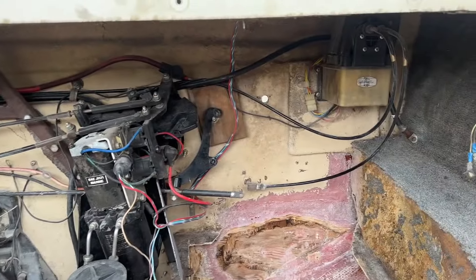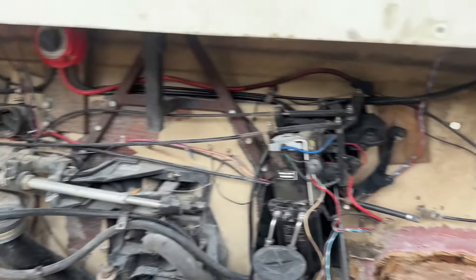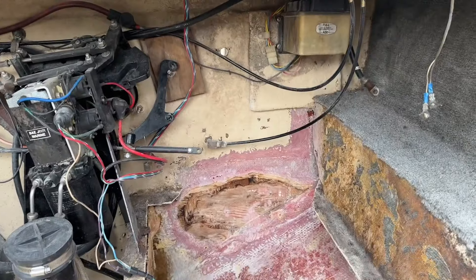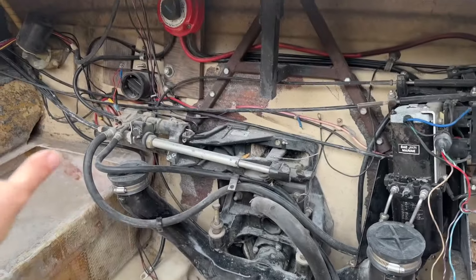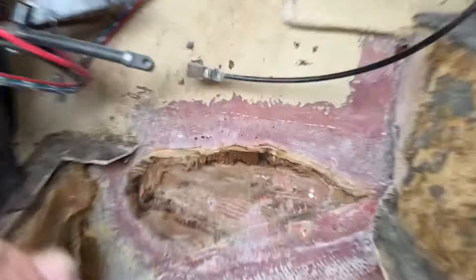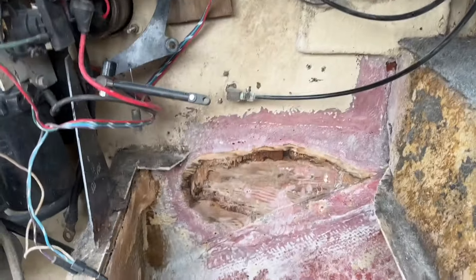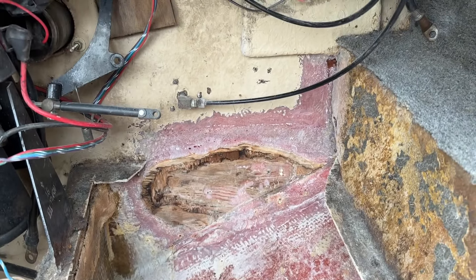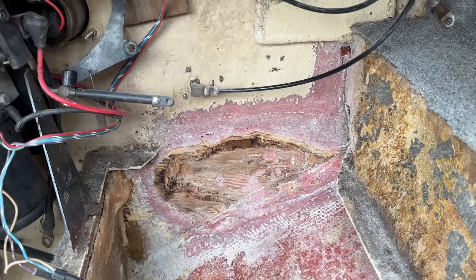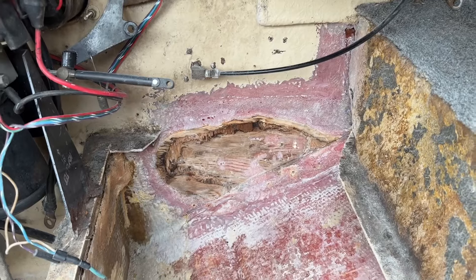There are YouTube videos of me working on this boat. So once it's fixed up and somebody does worry about the transom, they can pay somebody to do that because that's a big job and everything is pretty solid all around here. The transom itself is very solid, but there's going to be moisture in it — it's 40 years old, there's nothing we can do. We're doing preventative work where they mounted that trim tab and swim platform holder — they just did an awful job. It was totally taking in water there. It could have been a small little drip here and there, but being below the waterline, I do not trust that, and I wanted it fixed the right way.